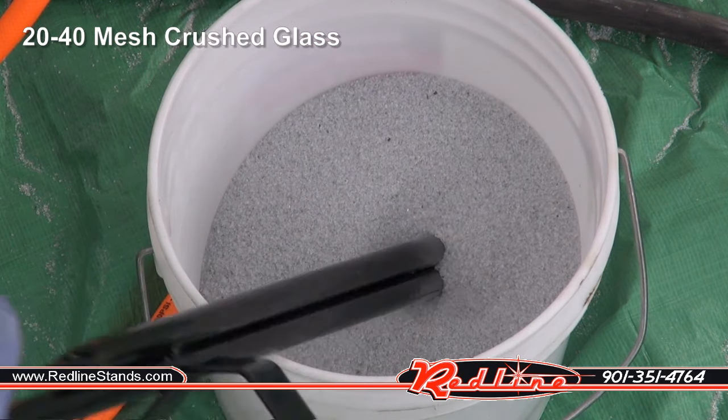Okay, so I have attempted to use the coarse Black Beauty. Unfortunately, it's not successful. The biggest nozzle that I've got for my gun is a 7mm, and it literally won't even flow it through that nozzle. Coarse was the only thing from Black Beauty that I could get my hands on locally. I have used this stuff before, and I can tell you from personal experience, if you get the finer stuff that will flow through your gun, it's great at rust removal. Does pretty well on powder coating, no idea on glass. So my test here for the Black Beauty is a failure.